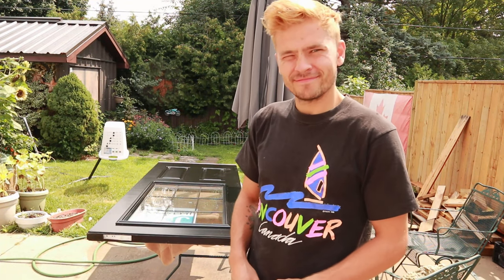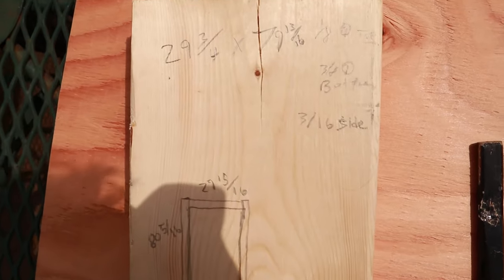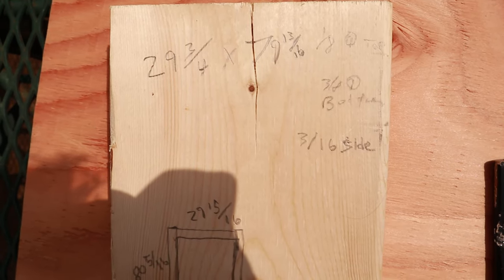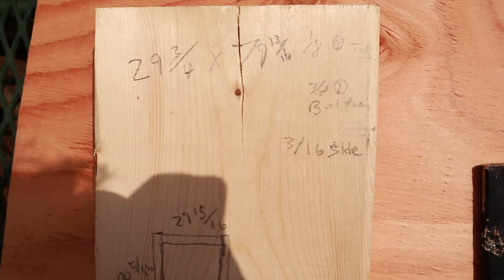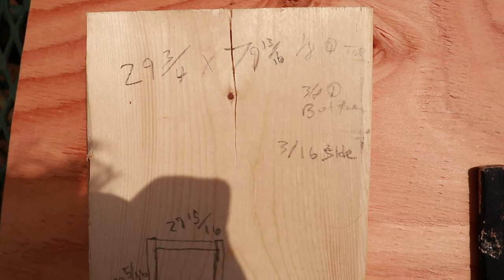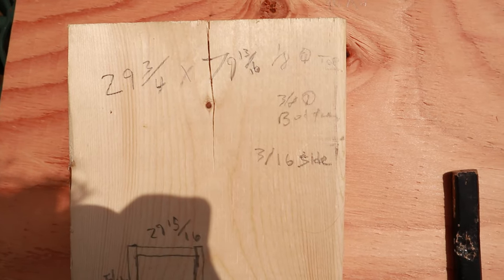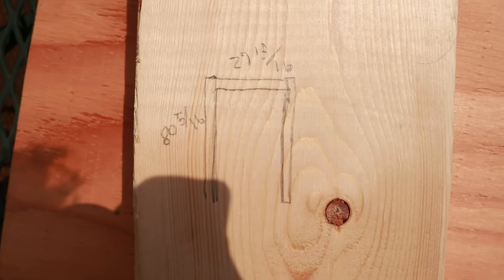Today I'm working on building a door jamb, custom of course to fit my door. I'm trying to be as precise as possible framing it out. My door jamb should be three-sixteenths larger than my door, giving it a little less than an eighth on each side. It should be about a half inch taller than my length, giving it an eighth at the top and three-eighths at the bottom from my threshold.